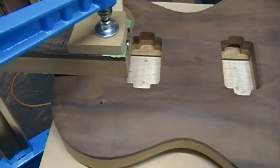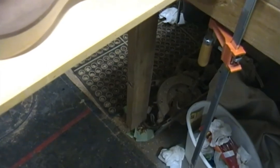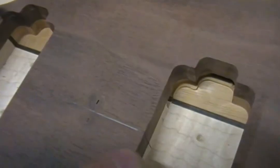I've been fiddling with getting the neck lined up for the neck pocket. I was doing it on the bench and it just didn't give me enough options once the body was over the bench to have good clamping up and back across here. So with this outrigger piece - a half inch piece of MDF clamped and screwed to the bench - I have the center line on the body, marked in the cavity on both sides of each cavity. Anyway, so I got the center down.